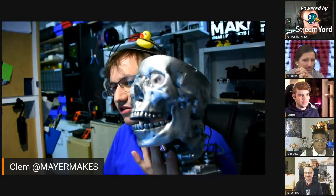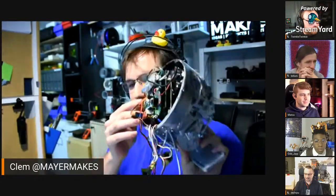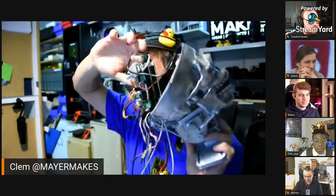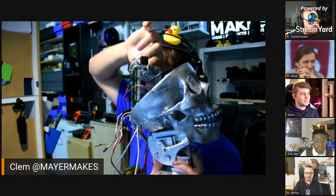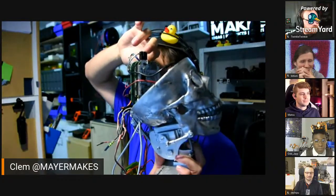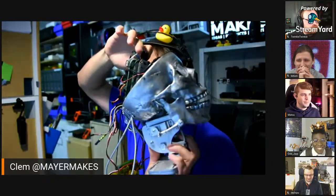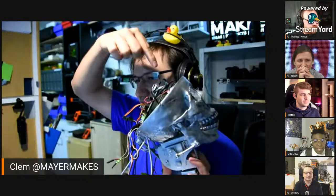we once had a comment from somebody that said it's pretty hard to finish a project that you start with BeagleBone. And in here, there's a lot of stuff. There's an Arduino Nano and a USB hub and some more boards. And the lowest one is the BeagleBone AI. That's the pre-release prototype, so that one has pretty much no driver support or anything. That's why I have a USB hub on there, because I faked the ID for the webcam that's in the eye over the USB hub.